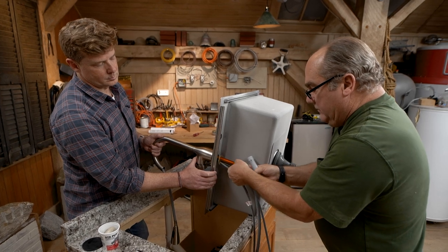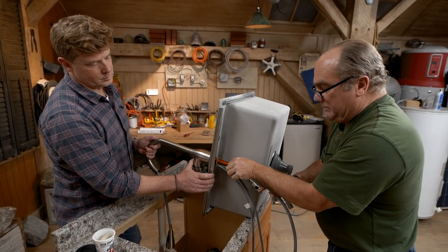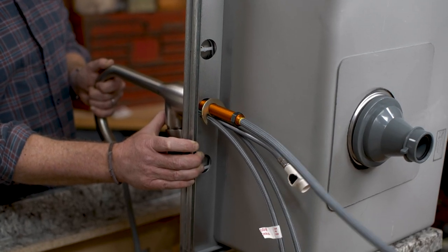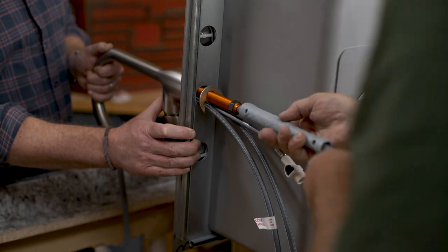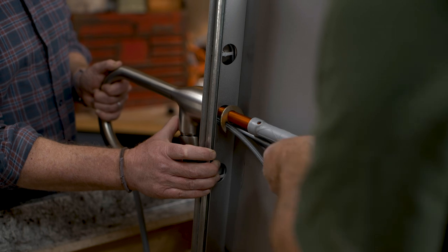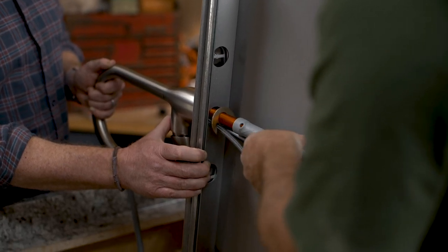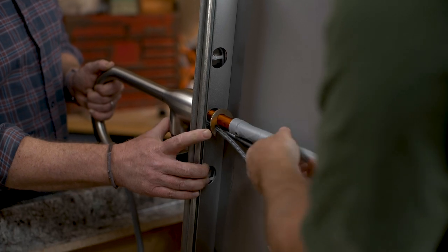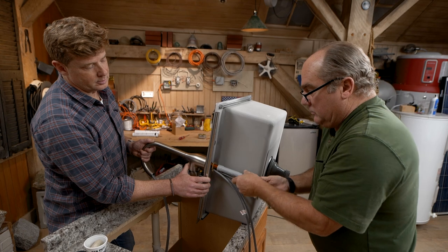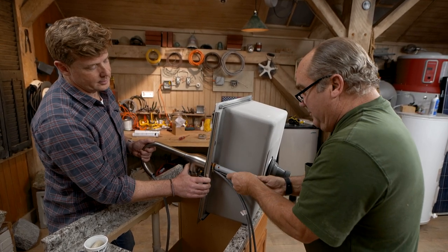What's great is that there's a nut that's up in a tough place normally. Well, they provide a special tool with the faucet. So now with this we can make that up. Remember all the times I've shown you the basin wrench — that tool designed to fit in tight places? No more needed. And this came with the faucet? Yeah, it comes with the faucet. It's a disposable piece, so you'll have a hundred of these in your truck at some point.